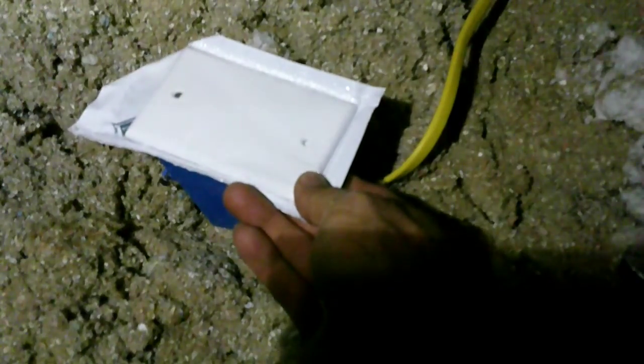So that was the wire that goes to it. What I did was I cut it in the middle here. I actually pulled out the staple that was down here, got myself a little slack, and made it up in this J-Box. I made it up with this yellow wire here — it comes from right over there where that little hole is. It will be made up for the box.